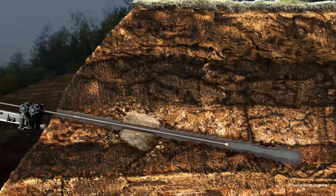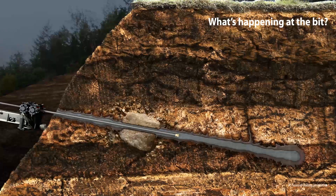When the hole is finished to the engineered depth, stop advancing and switch to the final grout mix. Thick structural grout is used to complete the installation. Plunge the bar three to five times or until the thick grout returns clean to the surface. Always be concerned about the drilling and grouting process.